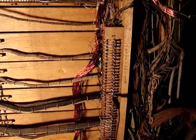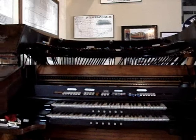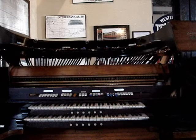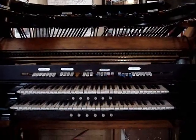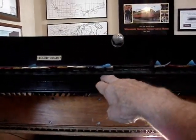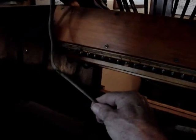25 pair cable. So my work is taking me into the realm of adding new wires in the form of a 25 pair cable, 50 wires. That'll cover the 30 center rail stop tabs that exist on the console. And I have to find out where these two go. They're add-ons, but they'll be easy to figure out because they go into this little gray cable here, and I can trace that through pretty easily. I wasn't able to find them by wiring it out.